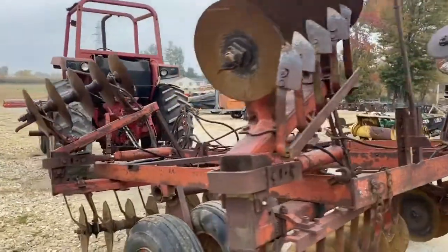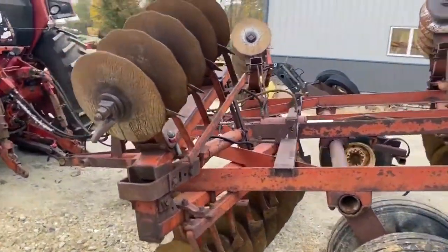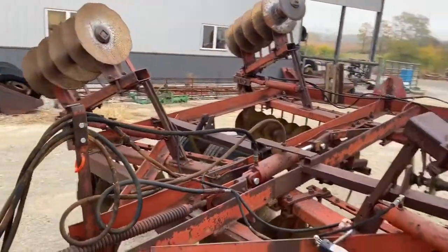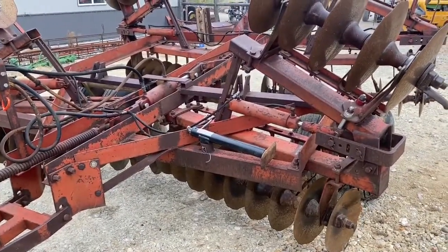They might have run the wings up a little bit. On the front I'm getting 16, 16 and a half average, and I do have some blades hitting 17 on the wings, maybe 17 and a half. So the blades are getting close — it's a good new ground disc or a cleared ground disc.